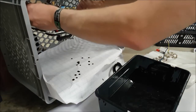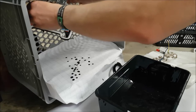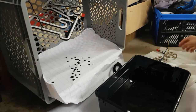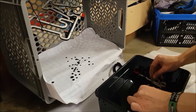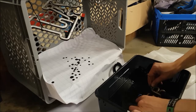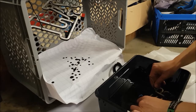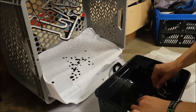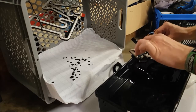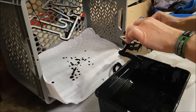Neon shops usually hang their tubes over their dipping container so that the paint dripping off goes back into the container, but I don't have that space and I don't dip that often, so I just use this paper. And here's the beer tube where I scraped off the blockout paint before. That was incomplete. I'm using those paint drips on the paper to go with a brush and do the fine adjustment on the finished tubes. Or if I have other signs that are missing just a bit of blockout paint, I use these paint drops on the paper to take the paint from there.